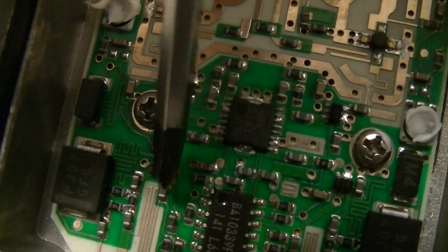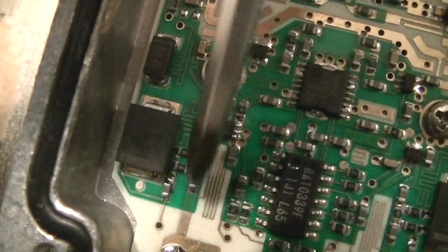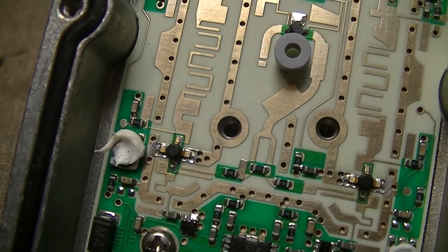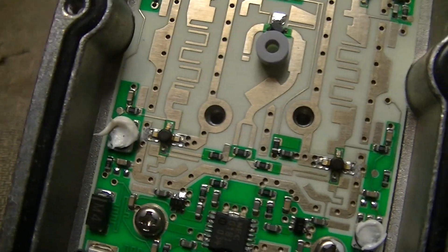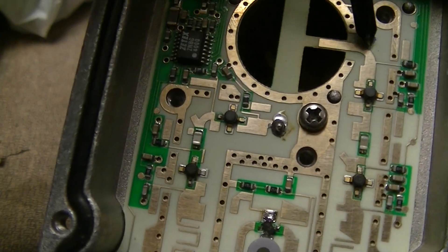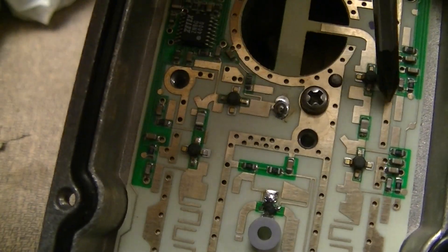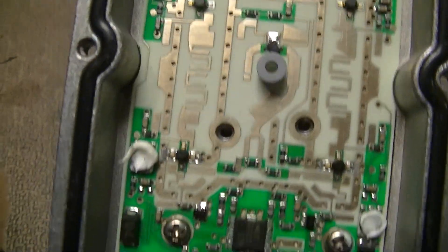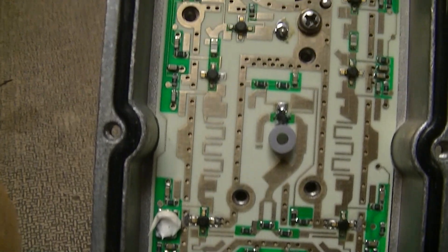Again more RF/DC blocking caps on the RF signal out, and fairly wide traces — because wide traces help reduce inductance, which reduces attenuation. That's why you can see wide traces where you want RF signal continuity, and really skinny traces where you don't. So yeah, just a random interesting thing.